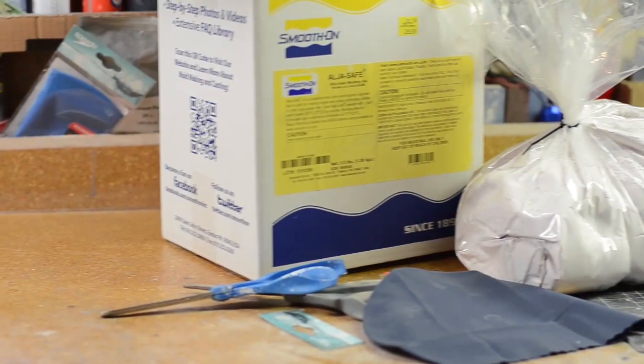You could make a silicone mold, but we went with alginate because it is a little bit cheaper. The downside is you only get one pull from the mold. So we went to our local pottery and sculpture supply store in Seattle and picked up alginate from Smooth-On, a whole bunch of plaster bandages, and some hydro-cal. If you can't find this stuff locally, it can be purchased on the internet — I've got links down below. We also needed Vaseline, a bald cap or swimmer's cap, a power drill with a mixing squirrel, and some very large buckets.